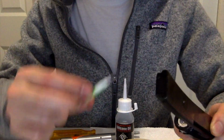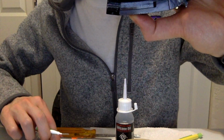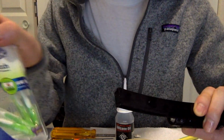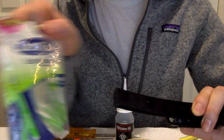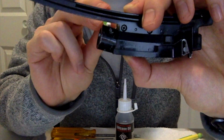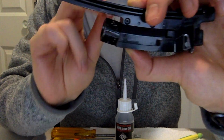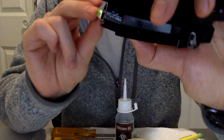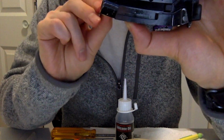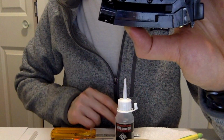It's also easier to see a line of the tube and the holes in the punch right there if you don't have grime in there, right? So I like to use this little brush for your teeth, because it's a very small bristle and it cleans very nicely. So you can clean out the metal shavings that, in my case, cause damage there. You can see there, and then same thing at the bottom one. Okay, there you go. So that's a lot more clean now. So you can see both of those straight through.